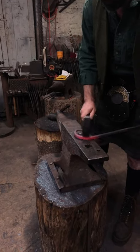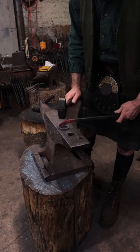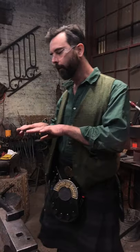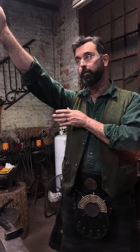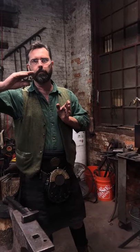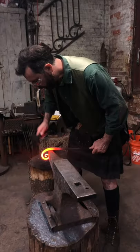I'll take one more heat and as I go through I'm just trying to keep this thing straight. A lot of people get lost in straightening scrolls — just because it's curved doesn't mean it's not a straight line. We're trying to straighten this way, and the bar is doing this, but if you consider it as a straight piece of bar and work through the rotation, you'll see the kinks one way or the other. If you've got a kink on a scroll, what it looks like is that the scroll is kicked out — but it's just a little bend — so be aware of that.